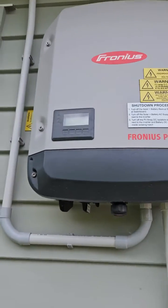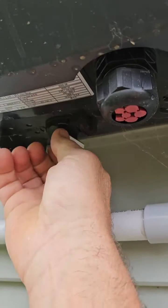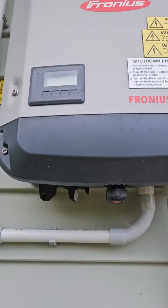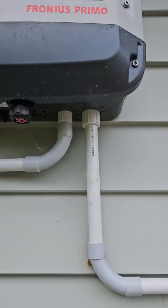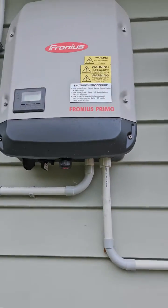The first thing you would do is shut down the DC to your solar inverter. This is a DC switch integrated under the inverter — it may be external or on the face of the inverter. Some inverters will also have an external AC isolator, which you could turn off as well.